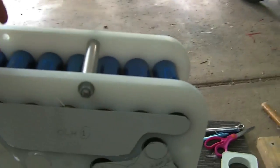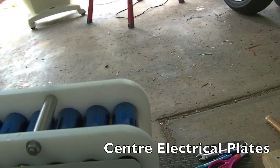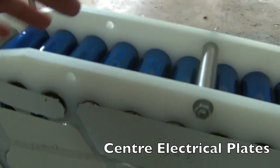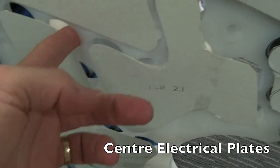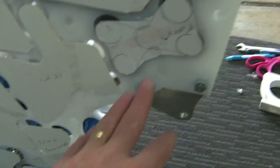All of the sense wires will have to travel through between the cells, through to the plates in the centre, between the cells here, through to the plates that are going to be in the centre between these two plates. And then all the outer sense wires will have to go onto these plates before going up to the BMS.